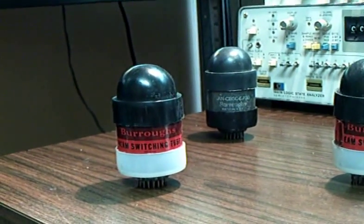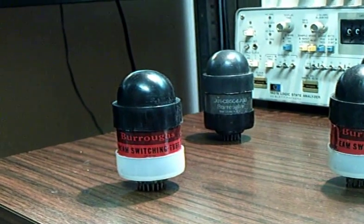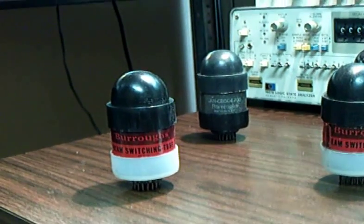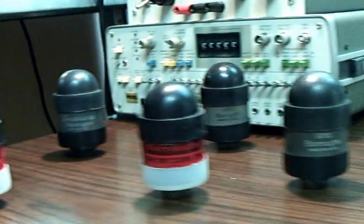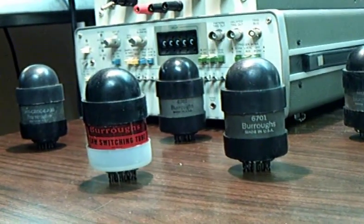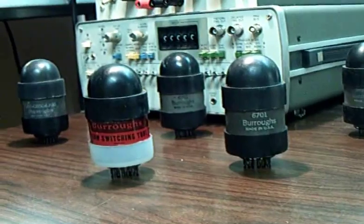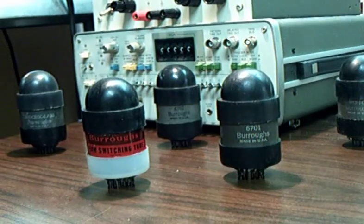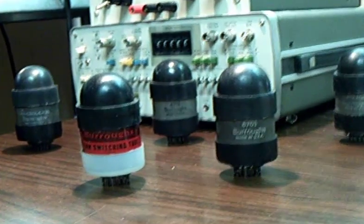These tubes count at 2 megahertz, which is twice as fast as any known Decatron. Decatrons don't go any higher than about 1 megahertz, and that's only for an extremely few. Most Decatrons operate in the 4 to 20 kilohertz range depending on the model. Over here we have these three — that's the Burroughs 6701. It looks almost identical to a Burroughs 6700, the only difference being that it's a low voltage variant and only runs at 1 megahertz, and it has support for something called grid zero, which is basically a faster resetting function than the earlier 6700 does not have.